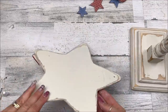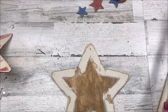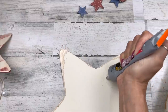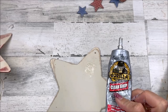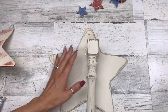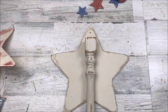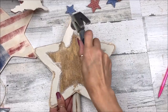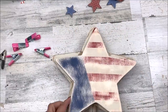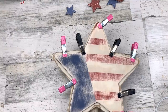I do use my electric sander. Here's what it looks like really heavily sanded — I wanted it really rustic. You could choose to go a little lighter or leave it as-is, but I wanted it really, really rustic. I'm using Gorilla Glue first, taking the larger star only, and gluing it to the base of the spindle at the top. Once that's set a little bit, I'll add some nails as well. For the double-star look, get the bottom star on first — if you glue the top star on first and then nail it, you'll see those nails. Using a combination of Gorilla Glue and Beacon Fabri-Tac Glue to get the top star on, then clamping for about an hour.